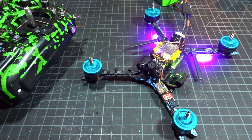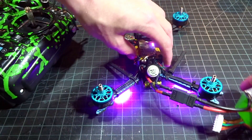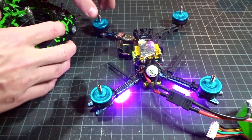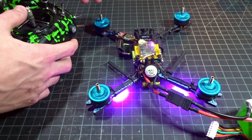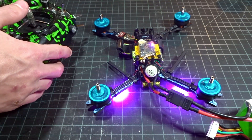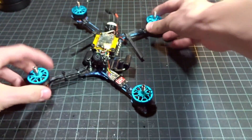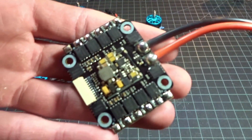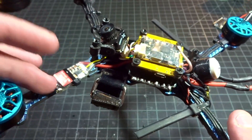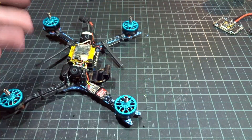The bearings don't sound that great in most of these motors as they've been crashed quite heavily. But everything looks good. As I'm spinning up the motors, I'm just feeling to make sure this one is spinning up accordingly. If I roll to the right, these two should spin faster — just feeling it outside. Yep, everything is looking real good. So that's pretty much it for this video on how to save a dead 4-in-1 ESC. Just a disclaimer: this is not how to replace any of the tiny little components. This is pretty much just a back-roads way of getting around one that just does not seem to work anymore. If you're smoking motors, you're bypassing the broken one and putting another one on the arm, and I've had no issues with calibration on D-shot — punch it and it'll go straight like normal.